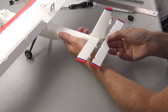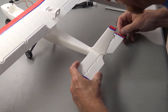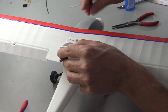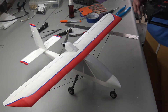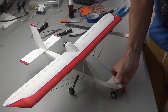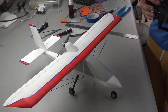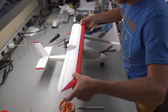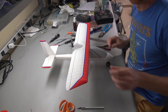The push rods are attached to the control surfaces first, then the control surfaces are held in place with a one millimeter diameter carbon fiber rod which acts as the hinge. From there it's just mounting the servos, motor, and other electronics and programming the radio. I'm utilizing one servo for each aileron, so I programmed some flaperons for more interesting slow flight characteristics — each aileron can be lowered to act like flaps while still maintaining aileron control. After a final balance check, I was pumped to take these tiny flyers out for a spin.